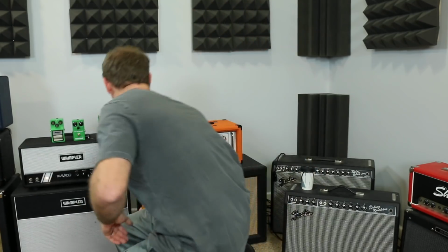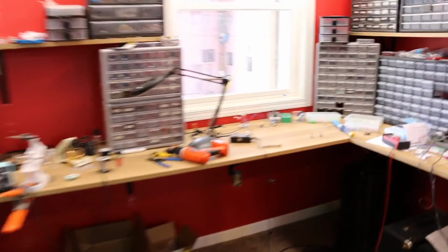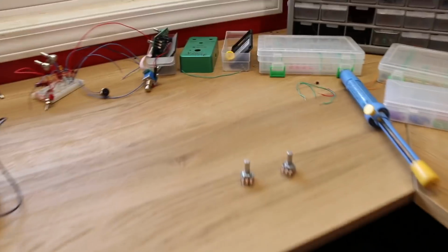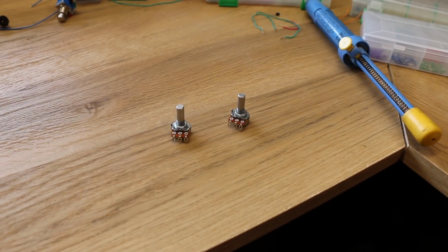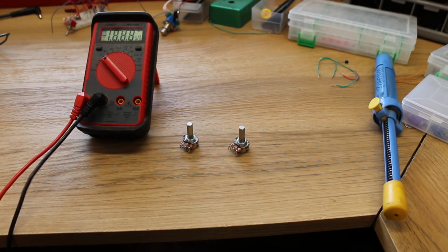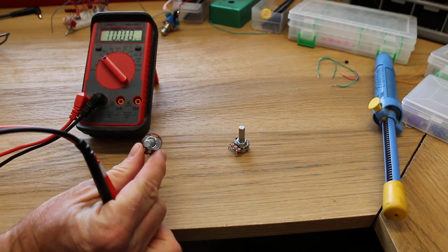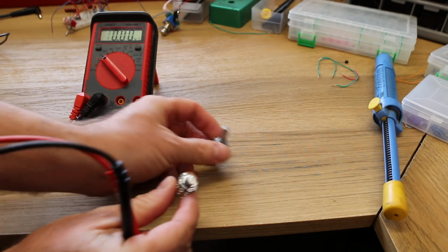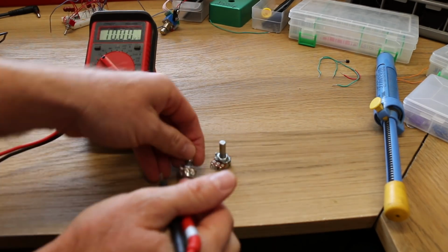Follow me, I'll show you. See that? Those are pots. Alright, so these pots, let's measure some ohmage. These are both 500K audio taper pots. Now, how do you measure a pot? You measure the outside lugs.